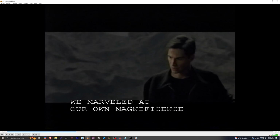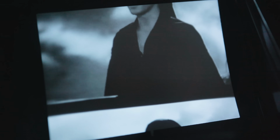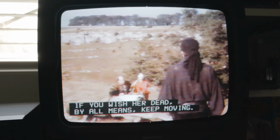Let me explain. I've talked about this before, but as a refresher, analog video is made up of hundreds of lines. Most of them are visible, but there are some lines at the top and bottom of the image that aren't. This area of the image is called the vertical blanking interval, and it's used by the TV to synchronize the image. But there are so many lines that are just wasted. When captions were added to analog video, they decided to put some pulses of light on line 21, which is within that blanking interval, to digitally encode the caption text. It was a good way to put toggleable captions within the already existing analog video standard, and then the TV just decodes this and puts it on the screen for you to read.